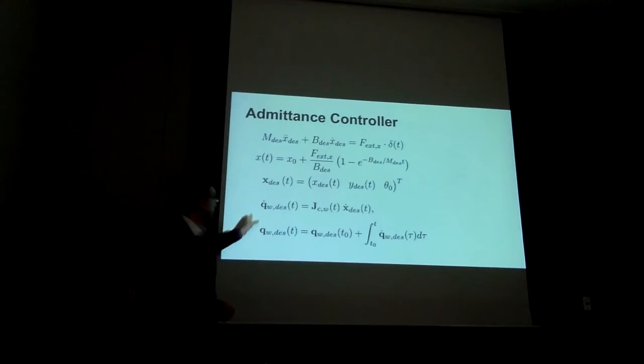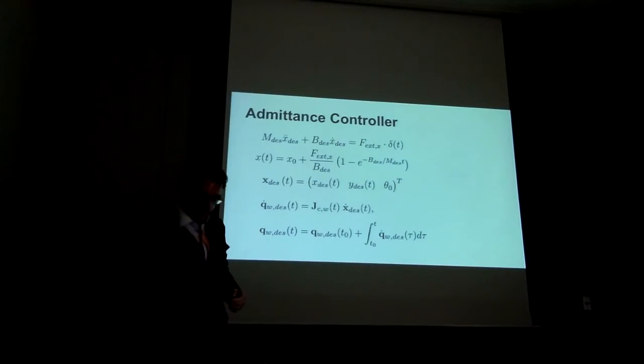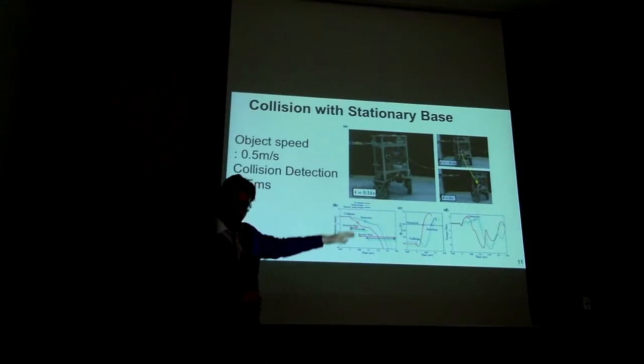And now using forward kinematics, we can actually calculate the velocities of the wheels, and then we have an impedance control on the wheels to produce the torques or the currents that will deliver that desired impedance. So pretty straightforward. For experimentation, we reuse the calibrated collision dummy that we saw earlier on. In particular, the magnetic clutch allows us to detect quick impact, but then comply to allow us more time for safety. We first collide the dummy on the upper part of the robot, up here, instead of the lower part.